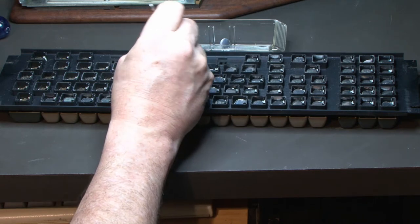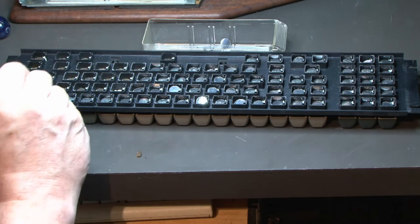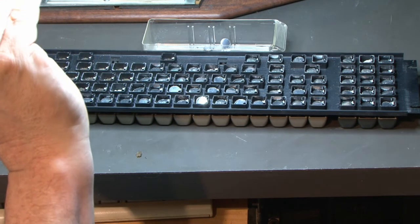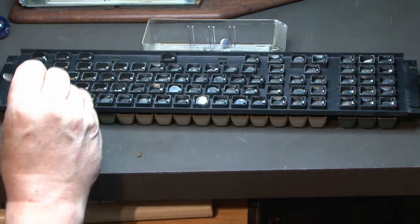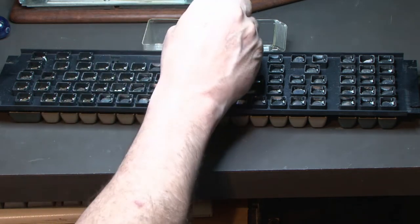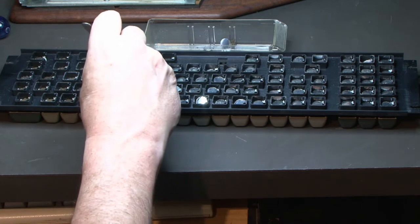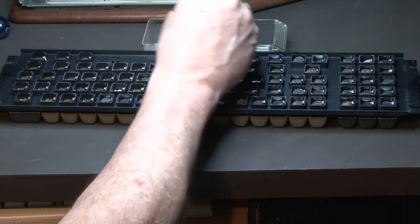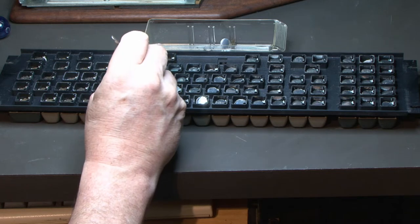Yeah, these foams are just completely disintegrated. These metal discs are just popping right off. So when you see it, it looks like it's metal, but it's not metal. There's a plastic coating over the metal. So it's not metal making contact with, and like closing the contact of the key. It's raising the capacitance. And I did find some information that says that a capacitance between 7 and 15 picofarad will activate the key switch.